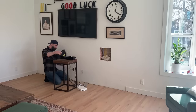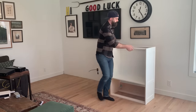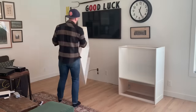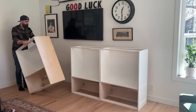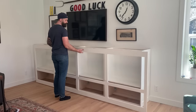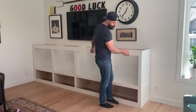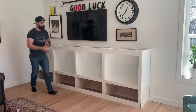Before we can start bringing cabinet boxes and everything in, I had to clean all the junk out of the way. I will divert that outlet up into the cabinet box, but we'll wait until we get everything in place to do that. So I just start loading these cabinets in from my shop. It's nice that I work so close to the job site. It's also nice that I built these in four separate pieces and not one giant 11-foot piece. I get all my pieces roughly in place and then I bring in my face frame. I just slide my face frame into place, stick it against the cabinet, and make sure it lines up good on both ends.